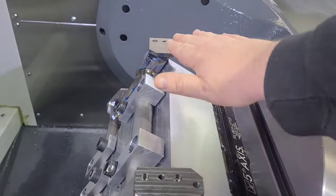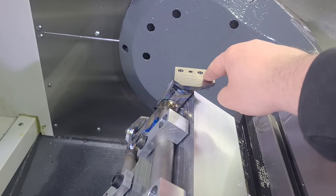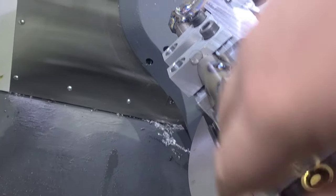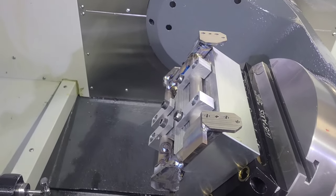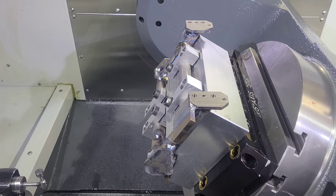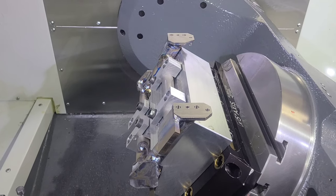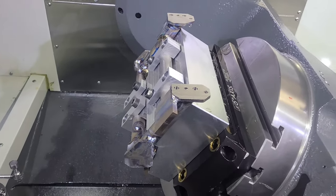On this one, this is our master plane that we have to work with, and this is our zero hole. From this surface and the center of this hole, we have to align everything else — the holes that go in here, the flats in this piece, and some that come down on these two tabs. You would think, being in a 5-axis, it would be simple to just set your zero here and flip it around, but when I went to program it, the programming software got confused and will not rotate everything around correctly because the machine's not set on zero.